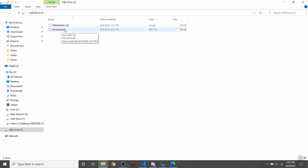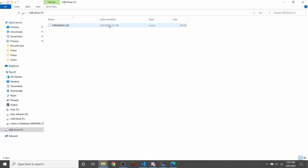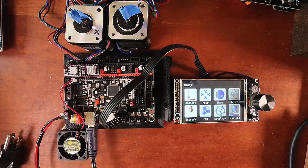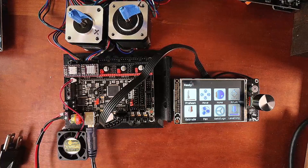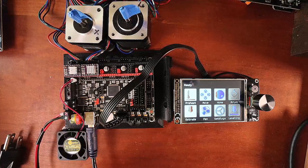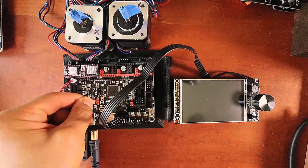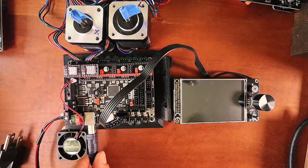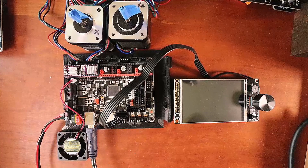I'm going to remove the USB power, then plug it back in, and you'll see that it's updated. It's updated just now. I've hooked up a fan and a couple of steppers, and right now it's powered off USB power. I'm going to disconnect the USB power, move the jumper over two pins and reconnect it, then connect the USB even though we're not using it, and then take the power from the power supply and plug it in.